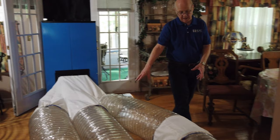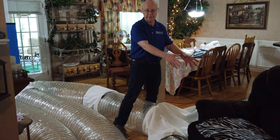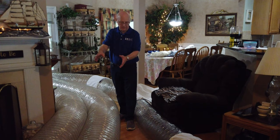In this layout we're going to have a Y3 — we're actually going to have a duct shooting that way to heat the couch, one around this way to heat the kitchen, and the third one focused on this chair. These other two duct works are going to heat the other back bedrooms. Each one of these are 25-foot lengths of flexible duct.